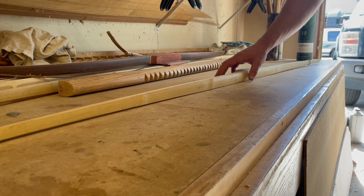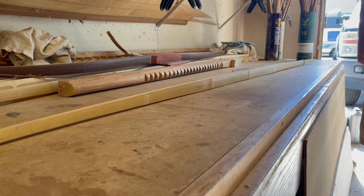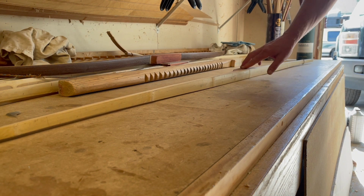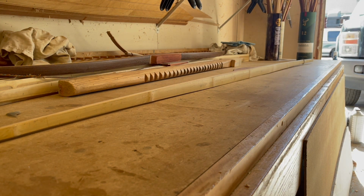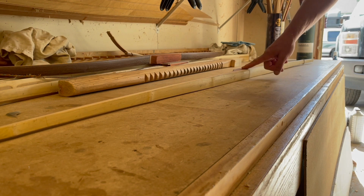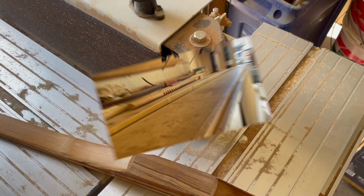Anyhow, we're gonna get this guy, he's like 9/10 tillered. Gonna go ahead and get it tillered out to full draw at this point. We were, I want to say, just a little over 50 pounds at 26 or 27 inches. Gonna pull her all the way out, get this handle fashioned out, and ready to roll. And we're gonna start putting some arrows through it.